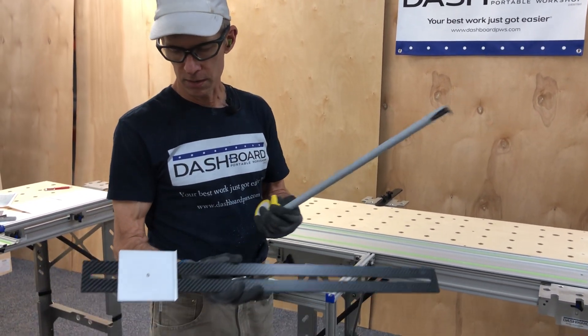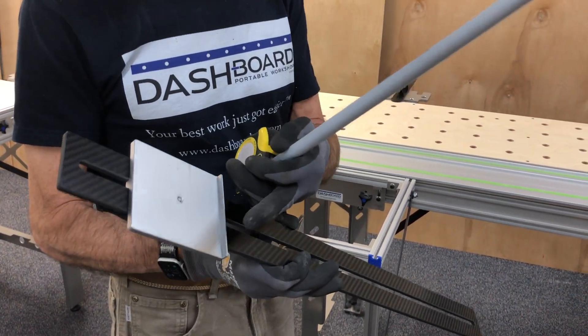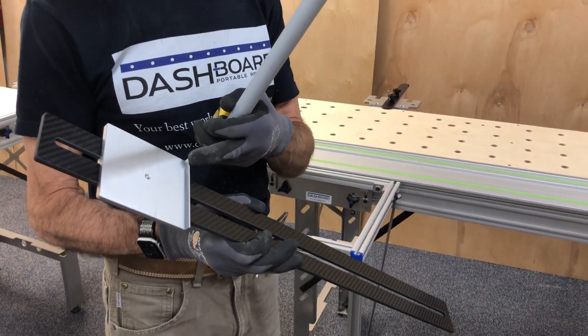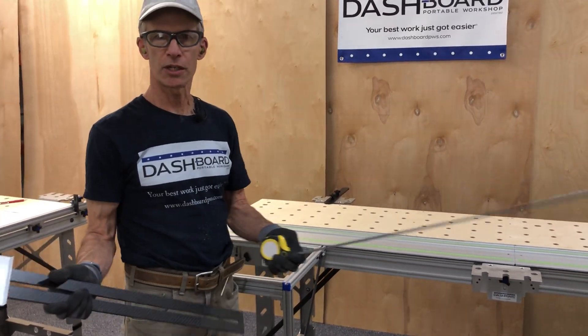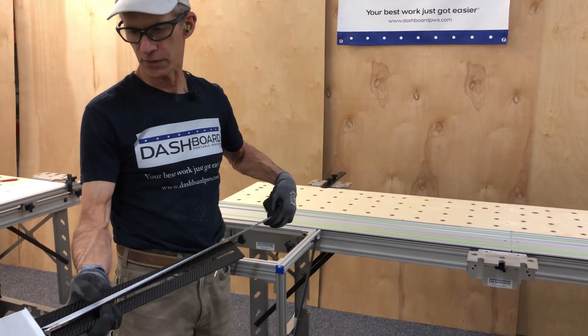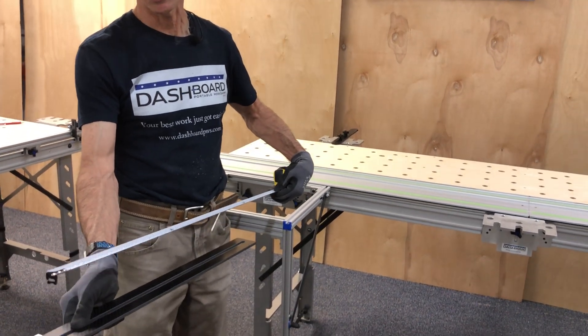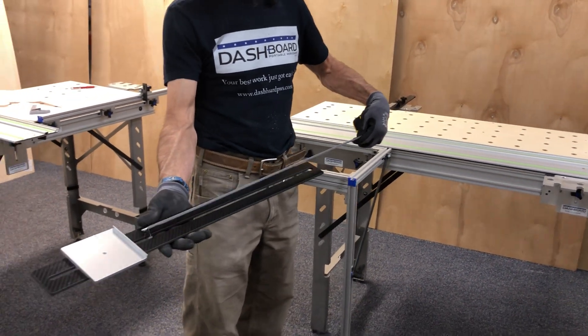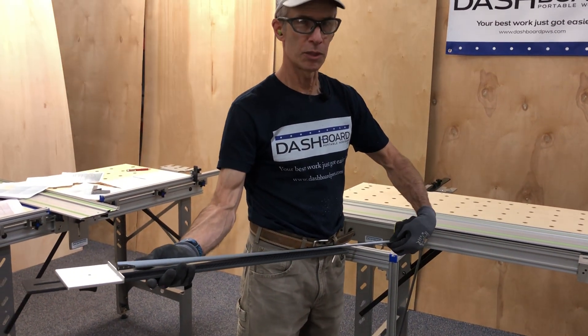The plate has a tab that represents the thickness of your blade. To set this, choose your dimension on the tape measure and set it against here, because this is what's going to be left from the cut. Then extend this by loosening the knob out to whatever dimension you want. Here we are doing 23 and three-quarter inches, or about 602 millimeters.